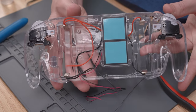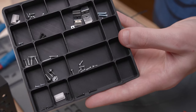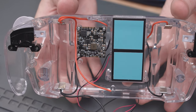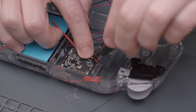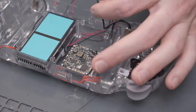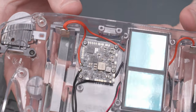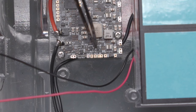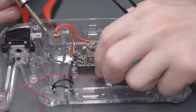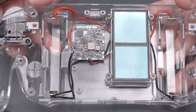After wiring up both sets of battery clips, secure the PMS2 to the Ashida case using the silver screws from the Wii shell. Then solder the positive and negative battery wires to the B-plus and B-minus pads on the PMS2 to get the battery wires out of the way. Next, solder the fan wires to the PMS. There are F-plus and F-minus pads on the bottom side of the PMS — the black wire goes to the minus pad and the red wire goes to the plus pad.